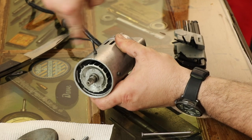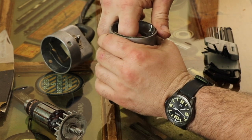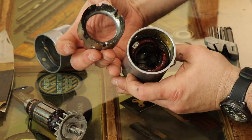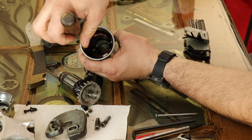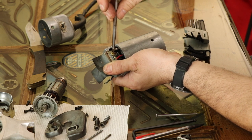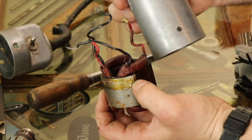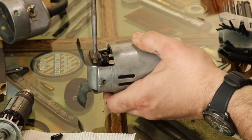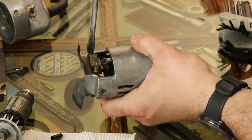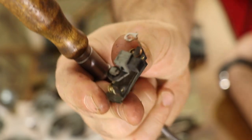There's the ground coming off, and then we're going to disassemble the bit that holds on the cord. These four Allen screws held in this baffle that I'm going to pull out — it sort of separates the fan and concentrates air across the motor. Now we're going to bring out the stator windings, disconnect the brushes, and knock that stator out. Greasy, but still pretty well covered in their lacquer.